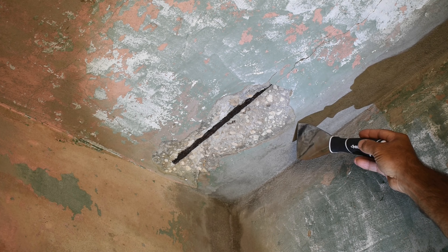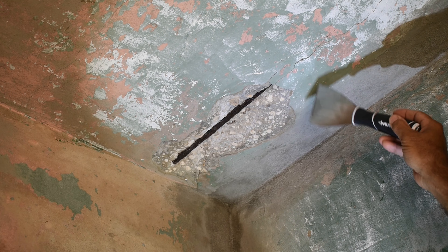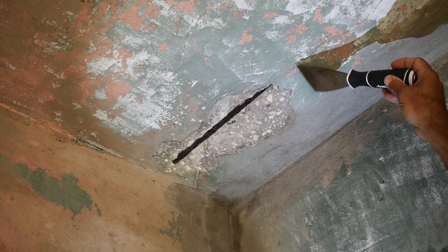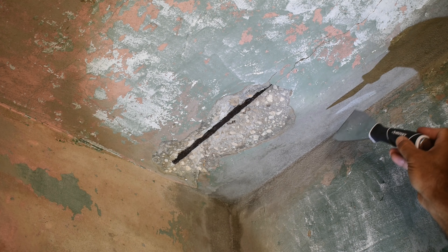Go from this point here — in my case to the wall — out to here, because we are going to blend in this repair area at the end, so you want to go further out. Take a scraper, remove any loose paint, any little areas of concrete that might be sticking down. And even better, if you have a pressure washer, I recommend pressure washing this entire area.